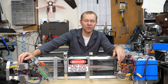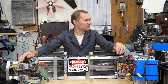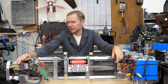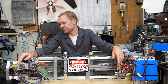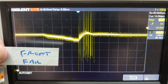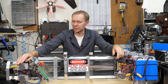It still worked fine enough to throw a bunch of knives. It was great, but when I first turned it on, just like boom, the first time it failed. I was thinking it was batteries, which is why I bought an extra battery here, but it looks like it might be a mechanical thing. So the ClearPaths just started faulting out all of a sudden with a bunch of firings, and I started hooking up the oscilloscope, and we could see these little spikes in the voltage when it happened, and that makes me wonder if, since these are already at 84 volts, it was enough of a spike to get up to 90, that maybe these guys would fault out.